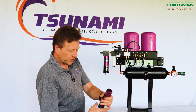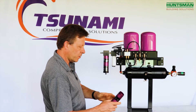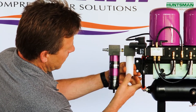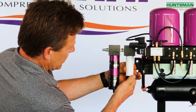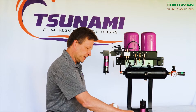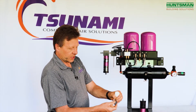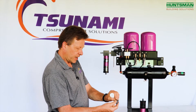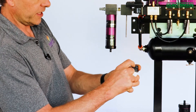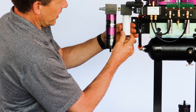Take the housing out. You can look inside, and take the bottom cap off if you want to thoroughly clean or rinse it out with hot soapy water. Loosen the bottom baffle — it unscrews. Slide your element down; it has a top adapter at the top. Take your old element, set it aside, and get your new element. The new element comes with gaskets. Take your adapter, place your gasket over it, and slide your new element in. There's an O-ring at the top of the adapter to make contact with the surface in the head so that we get a good seal.